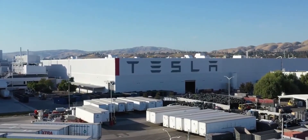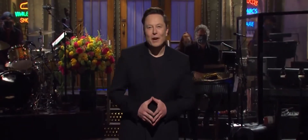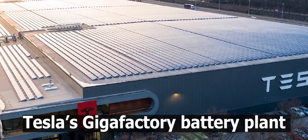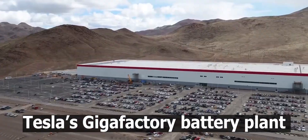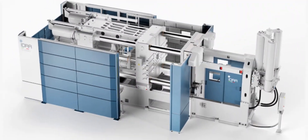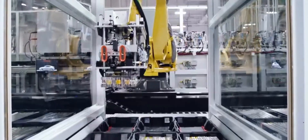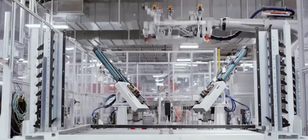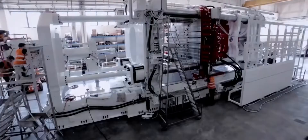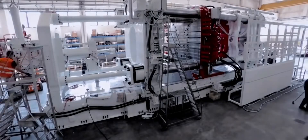There is no question that Tesla CEO Elon Musk appreciates the hyperbole of terms like Giga — hence Tesla's Gigafactory battery plant in Nevada. Many carmakers use die casting today for portions of the chassis that benefit from localized stiffness, such as shock towers. But Tesla is resolved to using giant die castings to replace the entire front and rear sections of the chassis, replacing multiple stampings that must be fastened together.